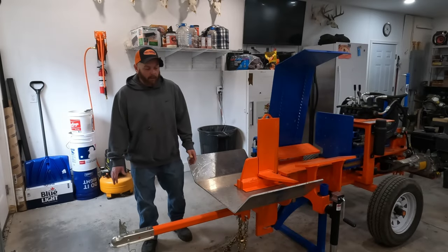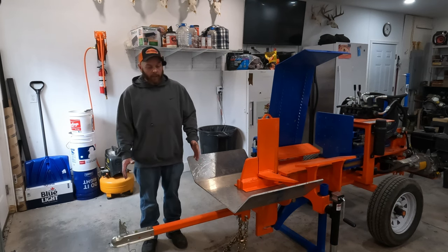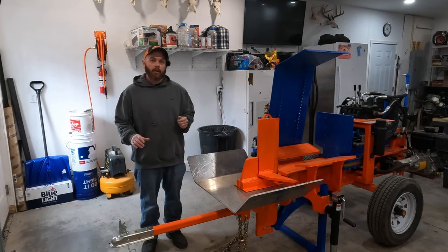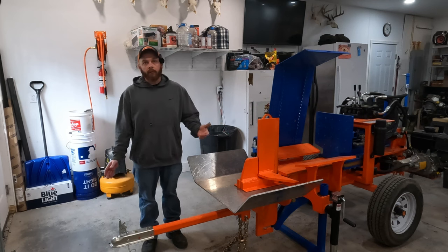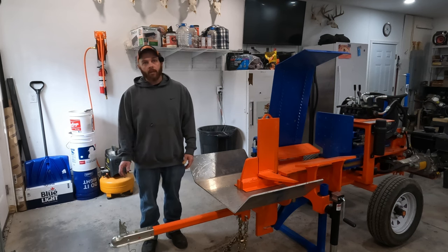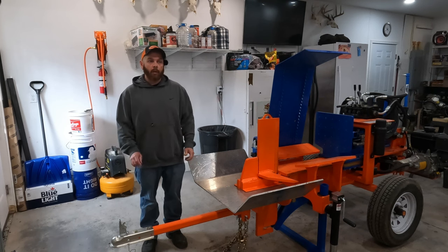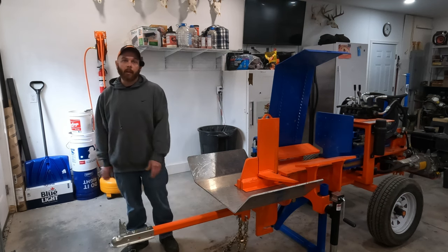Jennon over at 765 Guys had on his 1222 kind of an extension with slats going through it, and it did a pretty good job of getting junk out before it got to his conveyor. That's another reason I'm building this — eventually I'd like to get a conveyor, but my current budget won't allow me to spend $15,000, $10,000, or even $7,000 on one. I'll be looking for an old farm conveyor, hay elevator, or grain elevator. Hopefully this grizzly bar setup, a little beefier than Jennon's, gets rid of all the junk so the conveyor won't pull that stuff into my pile.